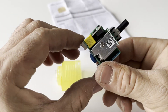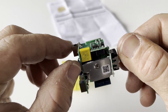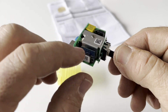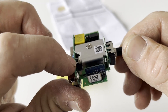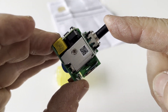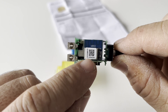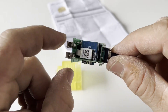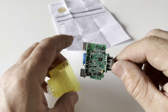I've just pulled it apart as I usually do, and it actually looks quite well made. This little dimmer has a filtering capacitor and a MOV to protect the MOSFETs from voltage spikes. It's got two MOSFETs on a heat sink plate, and it looks like there's a temperature sensor attached to the plate as well. It has a Tuya module — not an Espressif one, so you couldn't flash it the normal way — but it will work with Tuya Local and connect to Home Assistant.